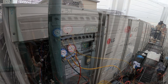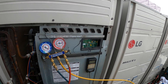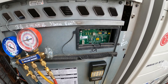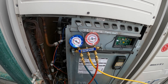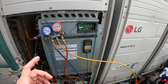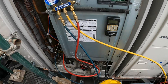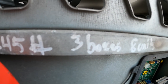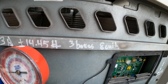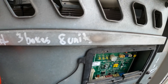So let's get started. In order to make this happen, you will need to turn the power on and adjust the main board into the right setting. Basically what you're going to do is open up all the EEVs and all the expansion valves to allow full flow of refrigerant so you get everything out of the system. With this one, we have one outdoor unit with three HR boxes — basically branch boxes in between — and then eight units.